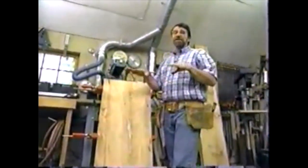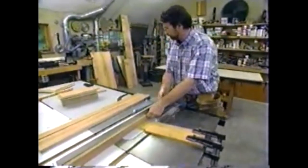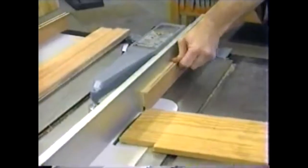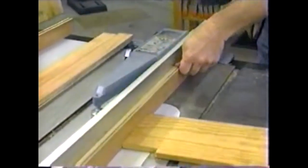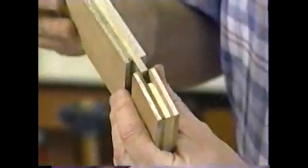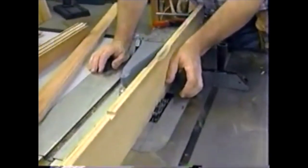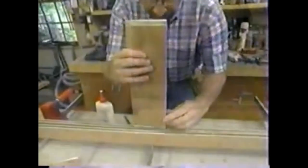While that dries, let's make a couple of dust frames to guide those drawers. I've been working with some three-quarter-inch plywood — the pieces that go across the cabinet need a quarter-inch wide groove a half-inch deep. I've got my dado cutter set at a quarter inch with a feather board to hold it against the fence. One pass on one edge, turn it around, run the other edge, and the groove is perfectly centered. To make the tenons for the cross pieces, I've widened the dado to five-eighths of an inch, set up a sacrificial strip so the dado head won't hit the fence, and adjusted the height so after a pass on each side I have the exact tenon thickness. With some glue on the joints, we'll slip the parts together, clamp them up, and pin the intersections with some brads.